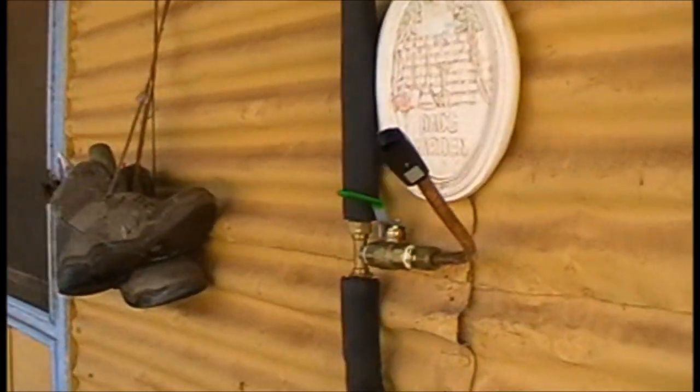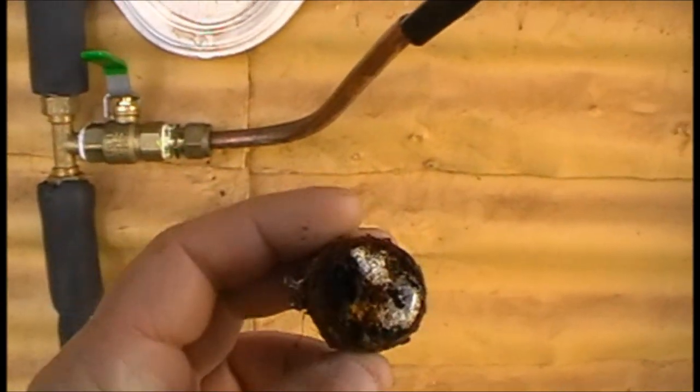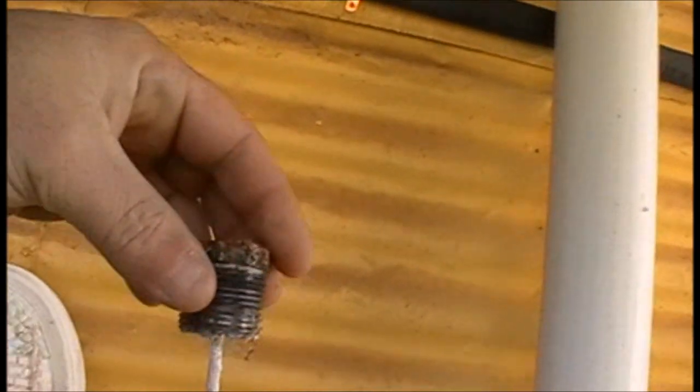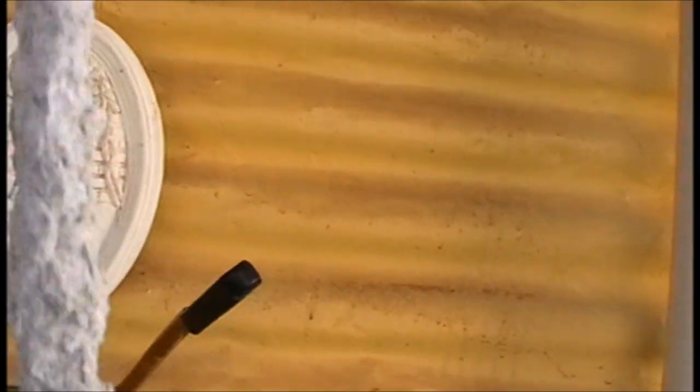The other things worth mentioning: both that tank and the one inside have sacrificial anodes. There's what remains of the sacrificial anode out of the batch heater's 250-litre tank in the box over here — so we took that out and put a brand new anode in to protect the tank from corrosion. And this one here is the sacrificial anode from the tank inside — it had maybe a little bit more life in it, but it was wise to replace it at the same time, so I went ahead and did that.